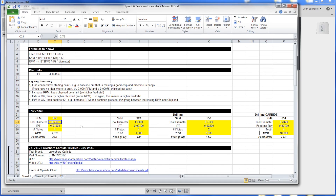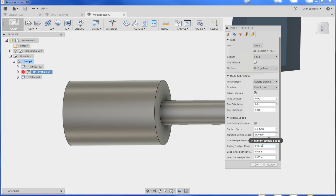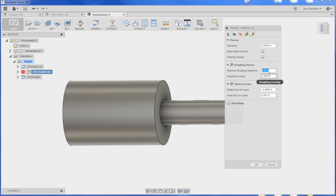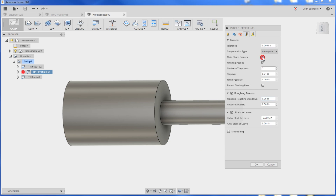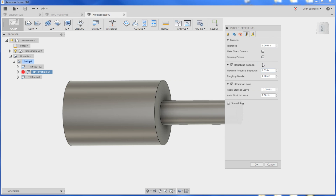When we're back down to the 0.375-inch final diameter, we're only running about 250 surface feet per minute. Surface feet per minute matters, but it's not the most important thing. What is important is feed per rev — we settled at 5 thou per rev — and depth of cut. The single biggest thing I did was turn off finishing passes. On the mill I'm hardwired to doing a light 5 or 10 thou cleanup pass to get a good finish and minimize deflection, but on the lathe we did a 50 thou depth of cut and dropped the finishing passes entirely.